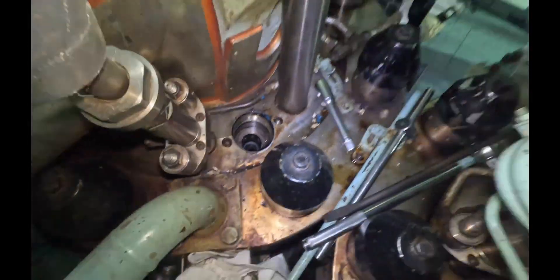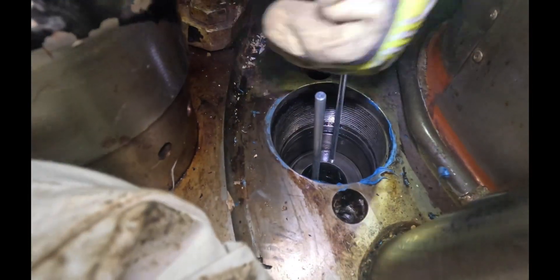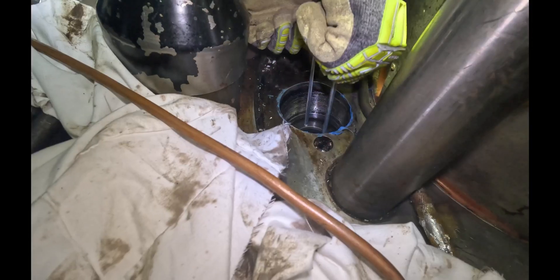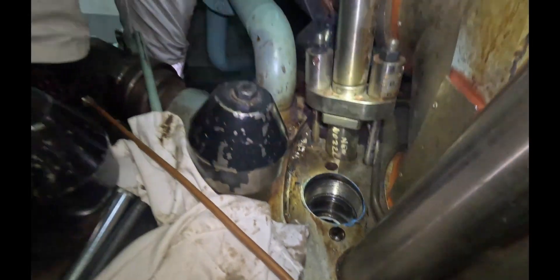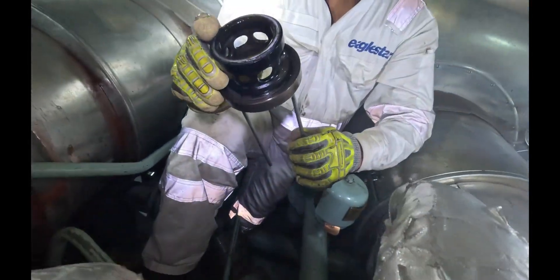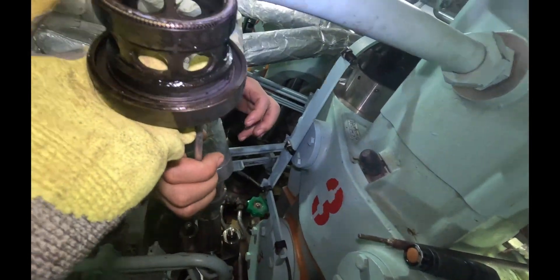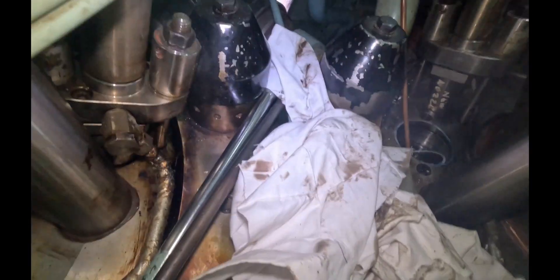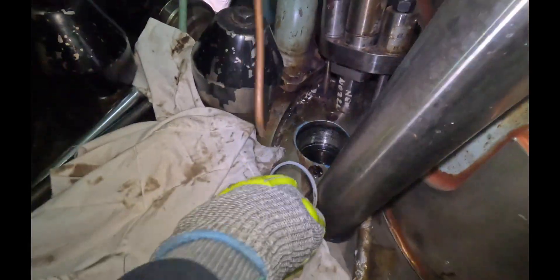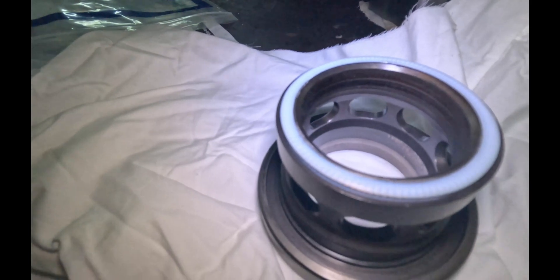This is the pocket. You can see the small part with two holes — that's your sleeve. We're putting in two M6 studs, just shaking and loosening the sleeve, and it should come off. If it doesn't come off, there's another way — you need to read the manual for that. See that white part? That's one seal ring that's damaged, and I think another one is stuck inside the pocket. Yes — this is the one stuck inside the pocket. The pocket is now clean and ready.